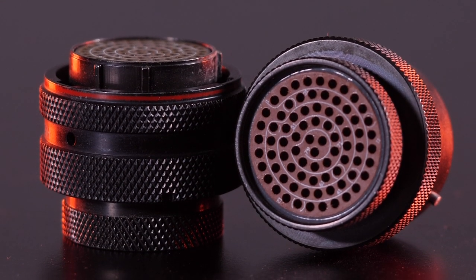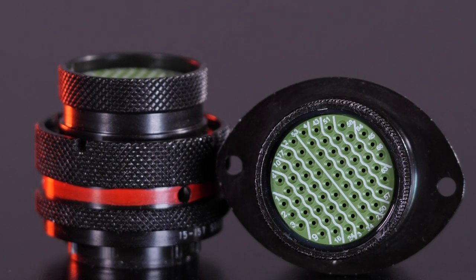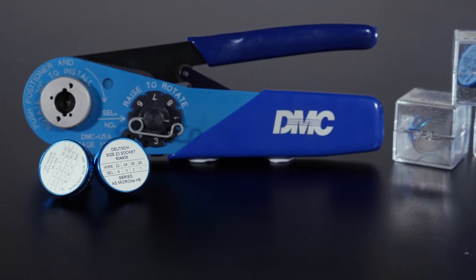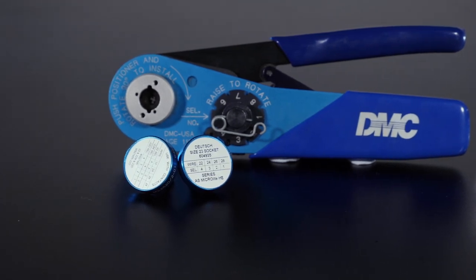What also puts a lot of people off is not just the cost of the connectors themselves — depending on the pin count and size, a pair of connectors could easily be in the range of $200 to $300 USD. But that's not actually the biggest expense. If you don't already have the tooling to work with these, things start spiralling out of control. You're going to need the industry-standard DMC — Daniels Manufacturing Corp — crimp tool, which depending on where you're buying can be a few hundred US dollars. You also need a set of positioners; there's a range of these depending on the specific contacts you're working with, and they locate in the crimp tool to ensure the contacts are aligned perfectly for the jaws to crimp in the right location.